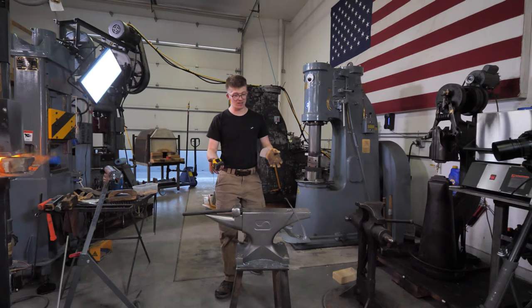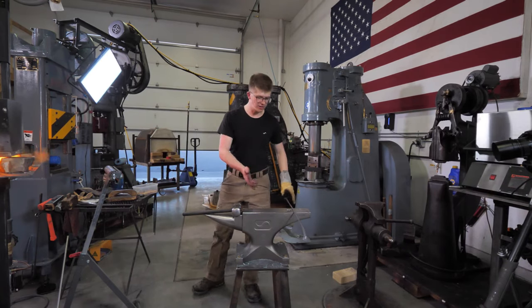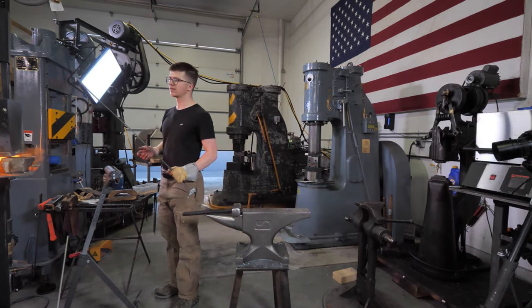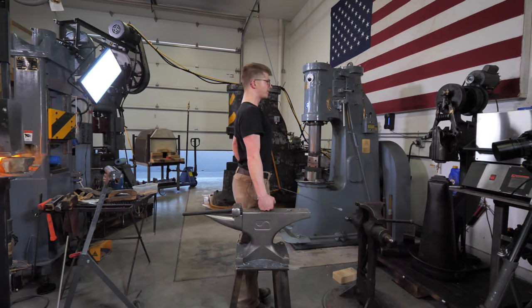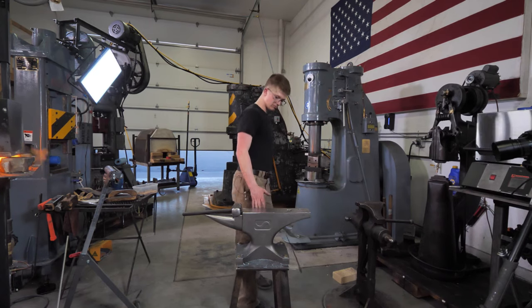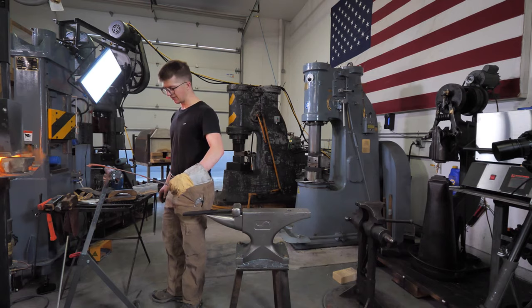This tends to be an okay kind of height, 32 inches. If you're an average height kind of person, a 32 inch anvil is a little too tall for me, might be good for you. So try that out, see if that works. People do things like saying, stand up straight and feel your knuckles on the anvil. That's kind of close. It might be a little bit high though, because I find this anvil's on the high side and I can barely graze my knuckles. You'll work it out. A little experimentation. You'll have a good time.